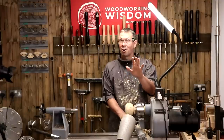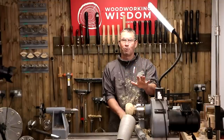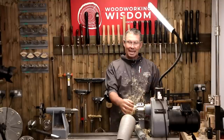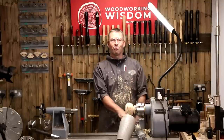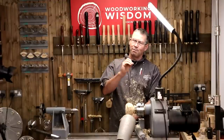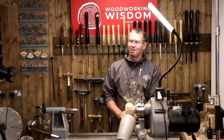And don't worry, not only problems with beginner woodturners, but even some of our staff here get problems when it comes to changing. So I do understand, you just got to follow the rules. You got to follow the sequence, 1 to 4. Make sure each jaw is gripped fully before you move on to the next one.